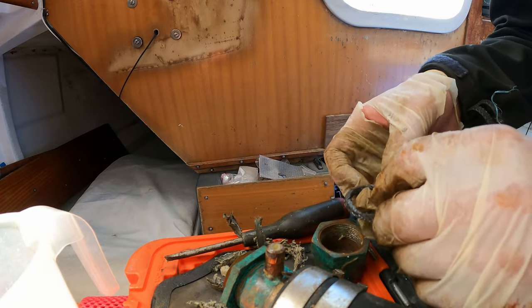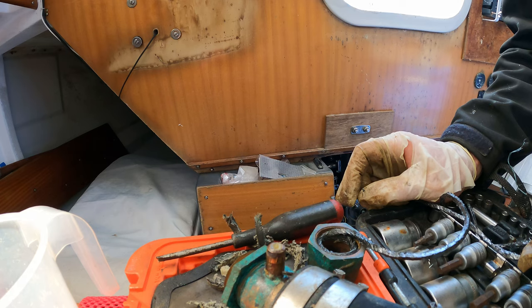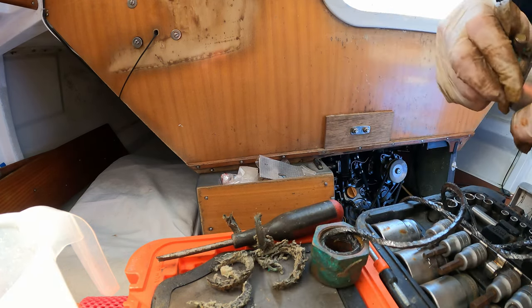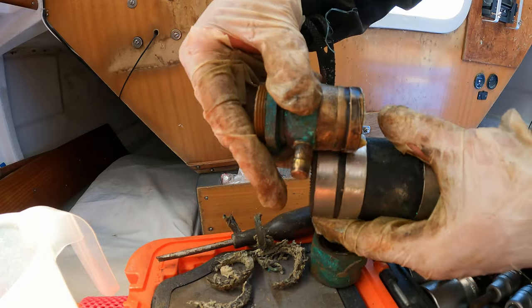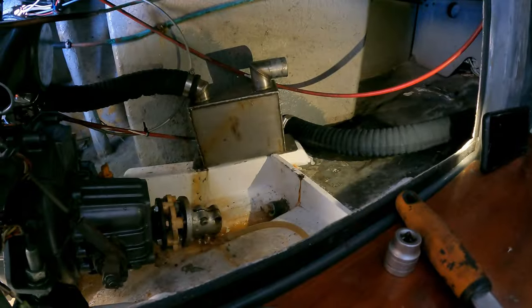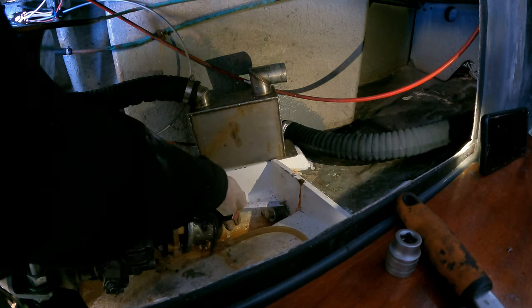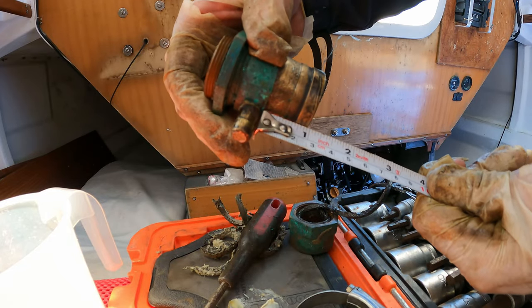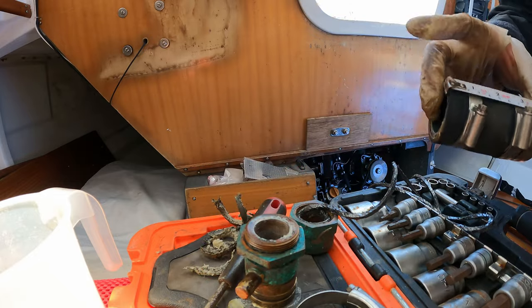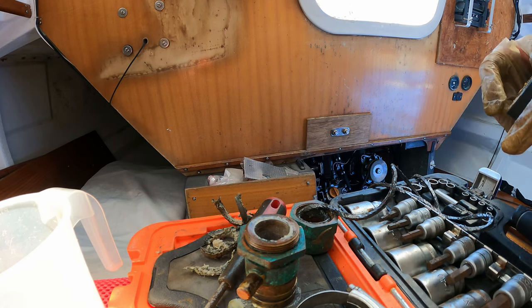It says to wrap it around the prop shaft, but I'm half tempted to just stuff it straight into the nut — mainly because that prop shaft is such a pain. Either way I think this needs cutting down. Actually, I could cut this down. Let me do a quick bit of measuring — see how far I need, how much of this stern gland tube I need. That's just shy of 40mm. This little one is an inch — so 22mm, 23mm. We've got 92mm. I want to leave a little bit of room for wiggle, so I'm just going to cut it slightly shorter.